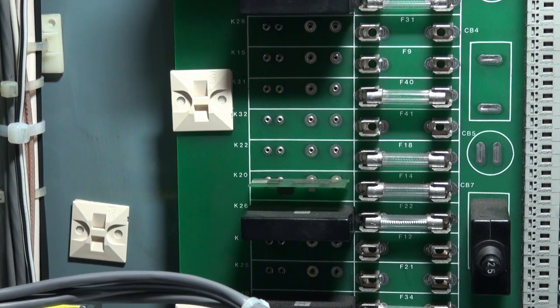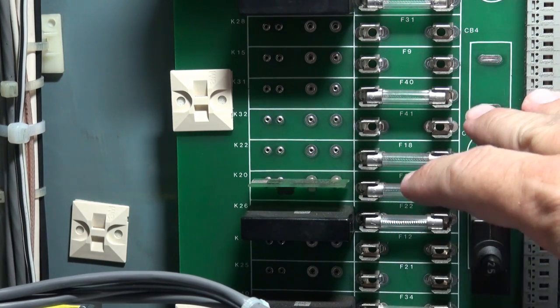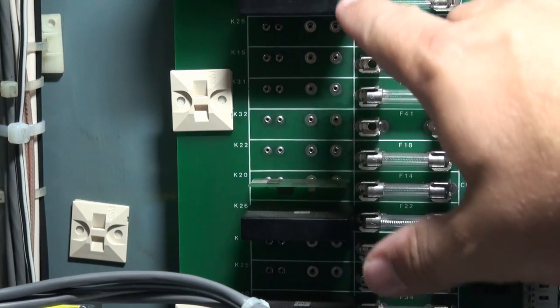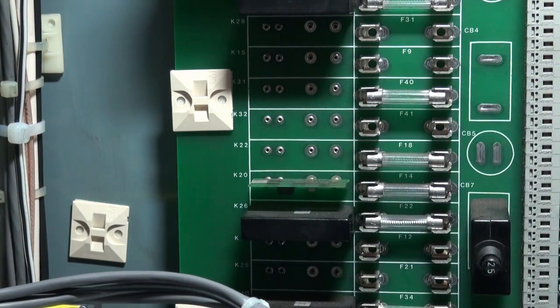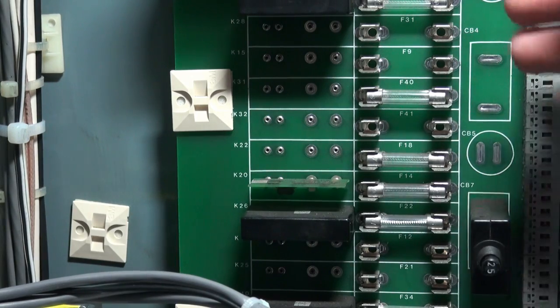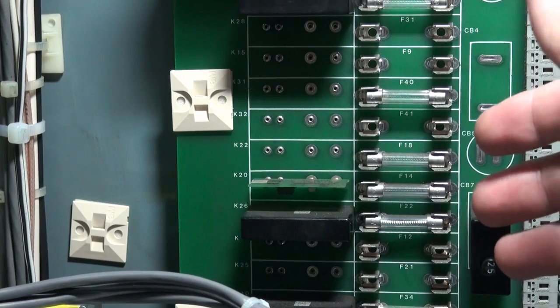I'm going to hook up the interface to the machine's outputs a little differently than you normally would. So this board is the 1100 board, and this board basically contains a bunch of solid state relays and some mechanical relays to turn stuff on and off. The coolant pump relay, I believe, goes through this and a couple of other things.